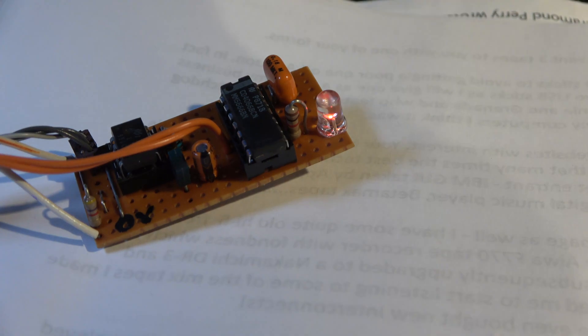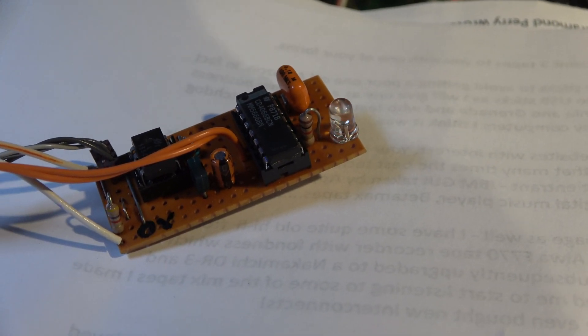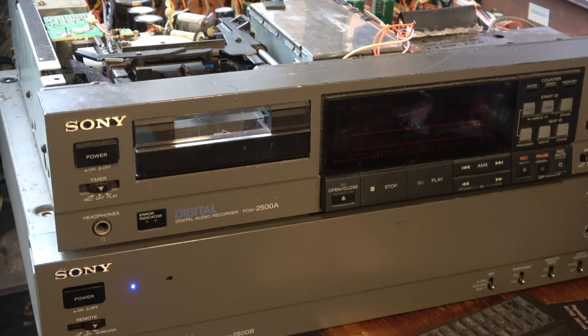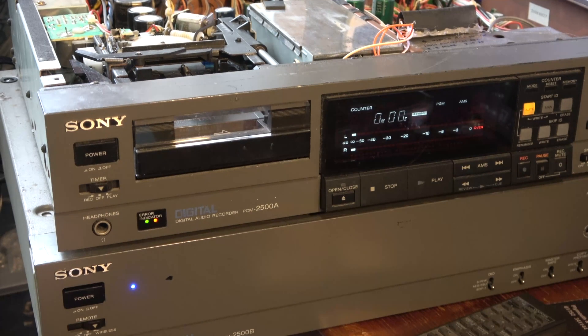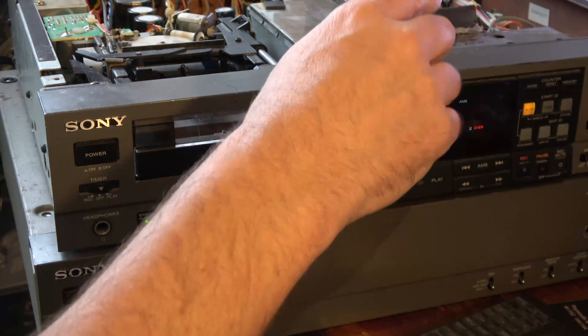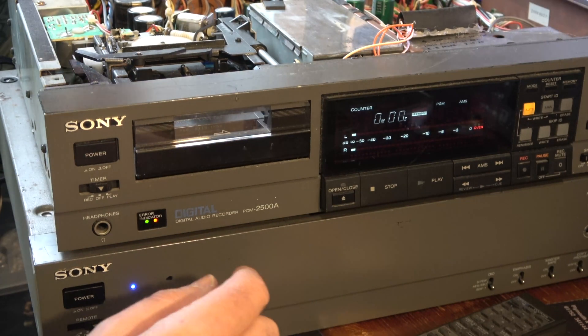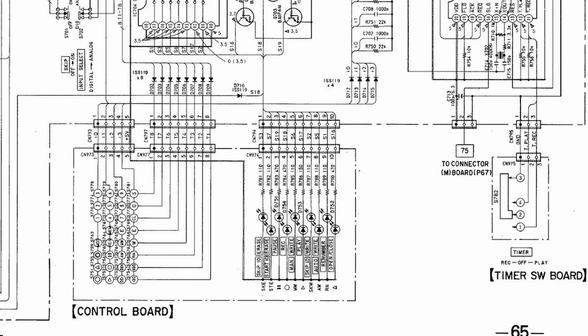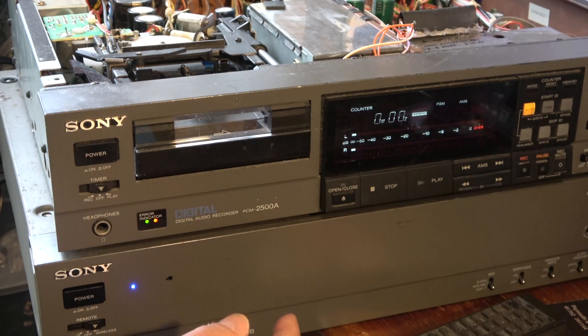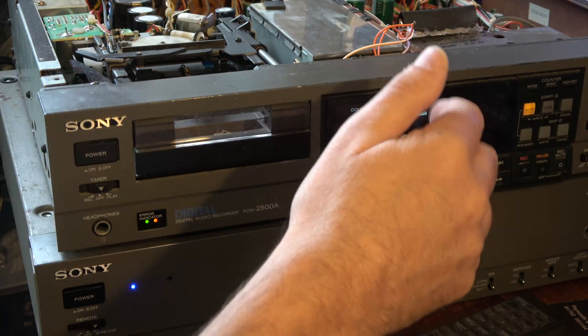I'm wondering if I can make this LED visible from the outside. I'll get it mounted and sort out the LED, then we'll try it. A difficulty I have is when this machine is switched on, depending which way around I have the analog contacts for the 4066 IC, I lose the ability to control either one set or another of the switches — I can do play but won't get eject to operate. If I swap the two wires that go to the 4066, the opposite would happen. Something about the 4066 is killing the matrix scan.